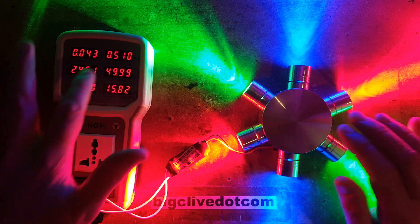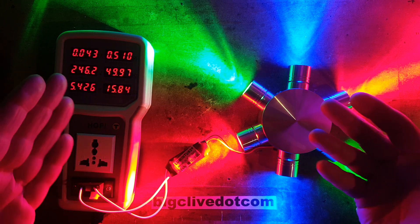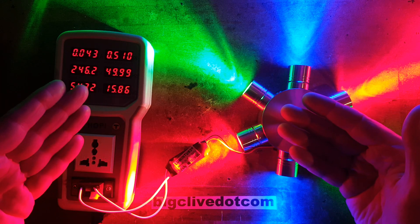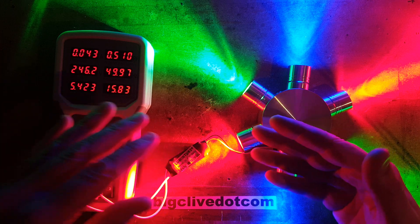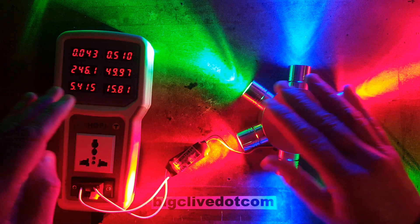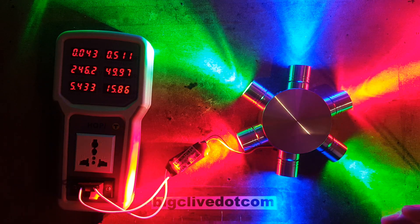As opposed to a 6-watt light. The power factor is 0.5, which just means that this almost certainly contains a power supply where the bridge rectifier feeds straight to an electrolytic capacitor for providing the initial incoming DC supply. That means all the activity happens at the top of the sine wave, which is why the power factor is a bit crap.